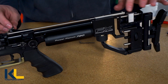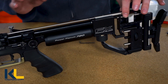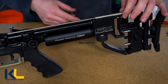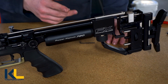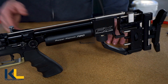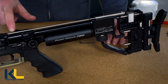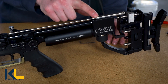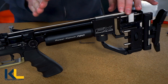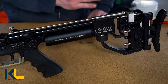In order to do the fine micro-adjustment so it nicely seats and nothing is too rough, you're not going to want to do another full 360 on this. I believe each revolution goes back about 0.7 millimeters give or take. So what you're going to have to do is about a quarter turn, which will move this back out about 0.2 millimeters or so.